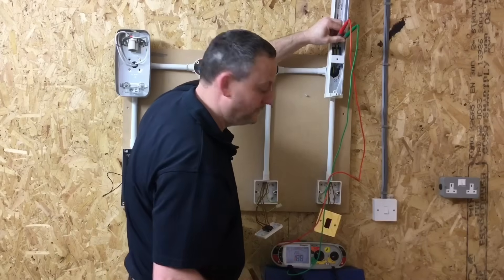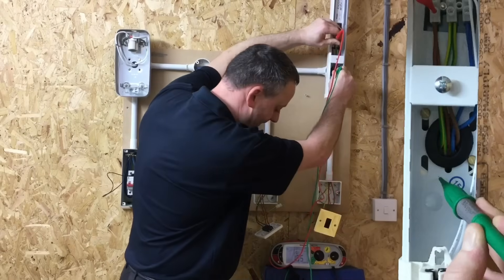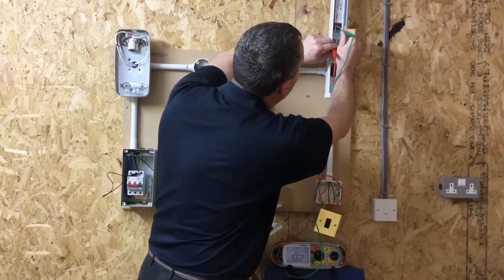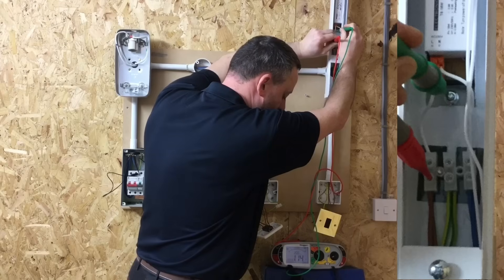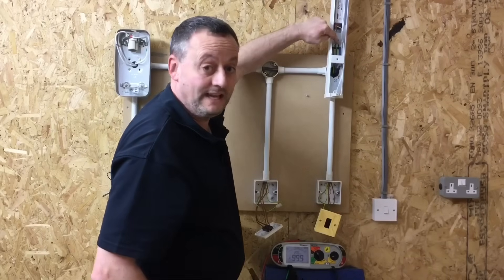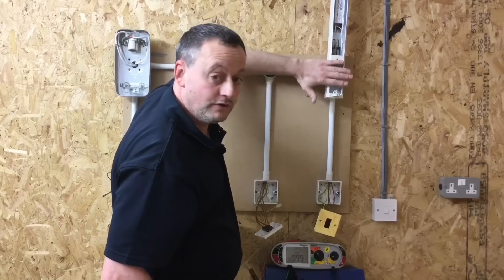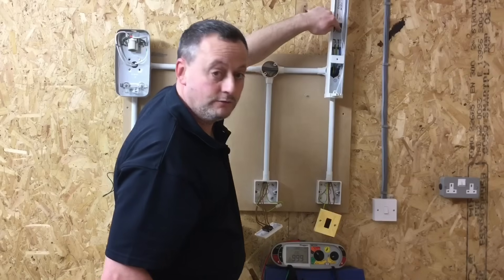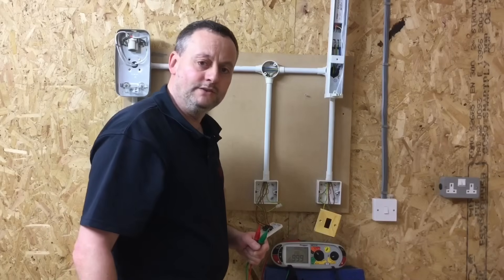We've proved the CPC gets into the connector. This is an exposed conductive part, so I'm going on the switching line and I've just scratched a little bit of paint away and I've got a reading of 0.1 ohm. Then going onto the bolt holding the electronic components, I've got a reading of about 1.03 ohms. So I've proved the CPC actually gets to the connector block. There is a tag at the back of these that sometimes breaks or is missing, so by removing paint on the inside and probing the metalwork and exposed bolts I've proved the exposed conductive part is connected to the CPC. We've checked the switches, so we've done polarity — we're now ready for the insulation resistance test.